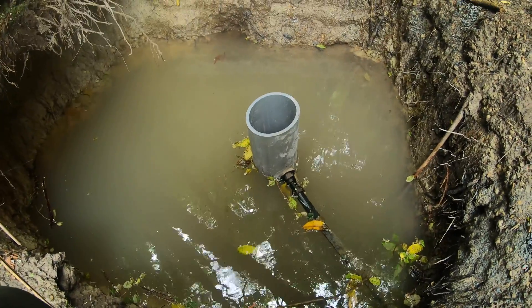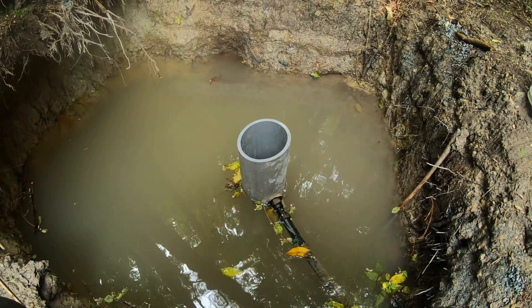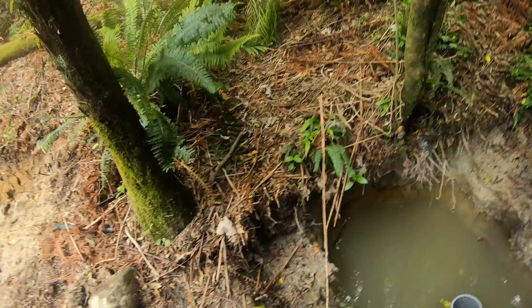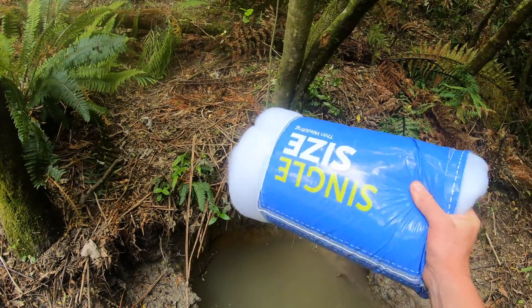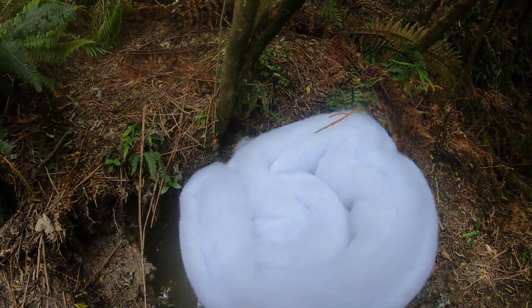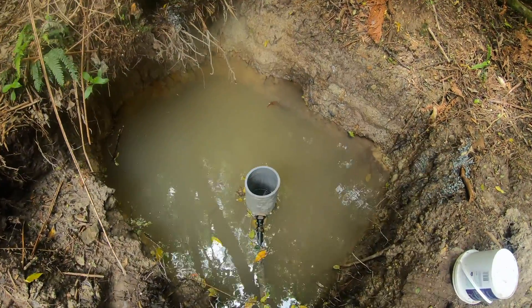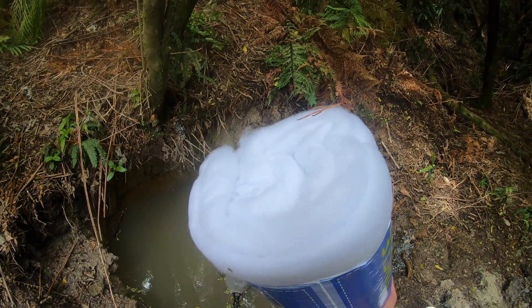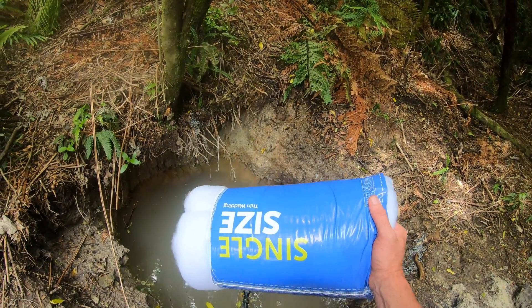But as this is clay ground there is still a lot of fine clay coming through, so the water is slightly murky. So I've bought this furniture wadding — it's really tightly woven nylon — and I'm going to roll this up into a tight column and stuff it down that pipe so that the fine particles hopefully won't come up through this. It'll just act as a filter.